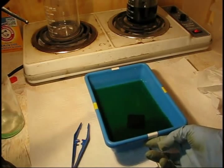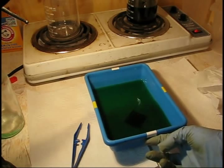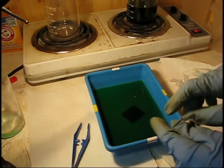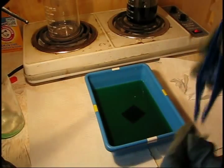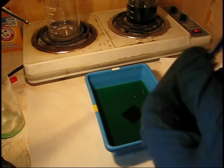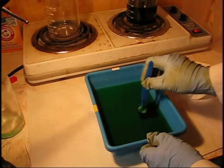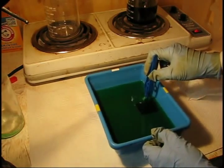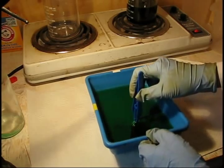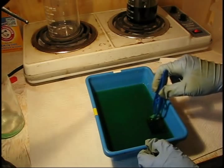Start rocking the mixture back and forth and it will start to eat away at the copper. Make sure the etchant stays warm and keep rocking it. You can also take a section of paper towel, fold it up, and place it in the grip of a pair of tweezers. Make sure all your tools that handle this directly are either glass, plastic, or very corrosion resistant — stainless steel will not be good enough, any metal will be a bad idea. You can gently rub the board if areas aren't etching properly. The etchant will start to darken if the hydrogen peroxide concentration drops; if it becomes really saturated you can dilute it with a bit of water, though it's really not necessary.